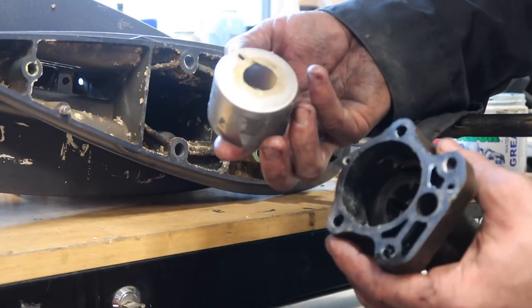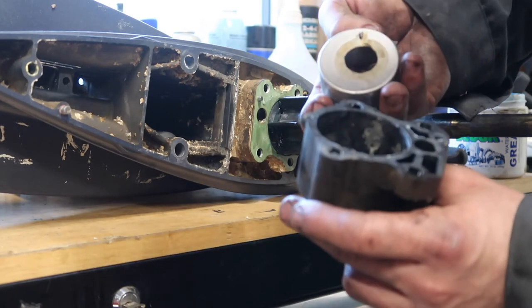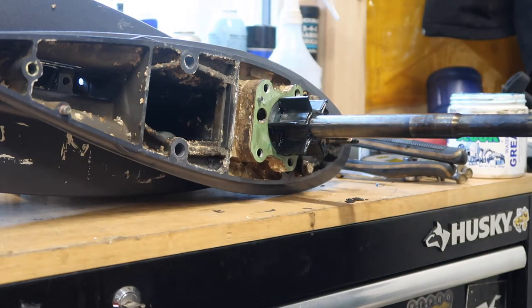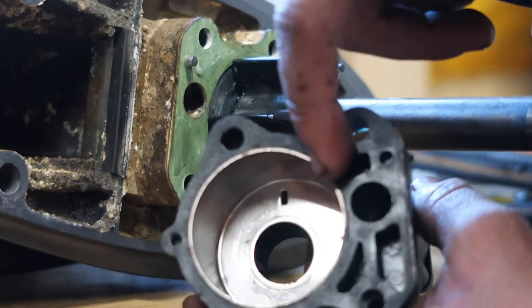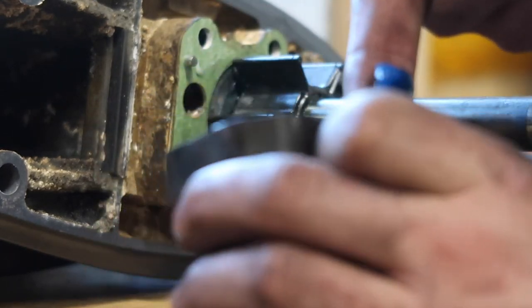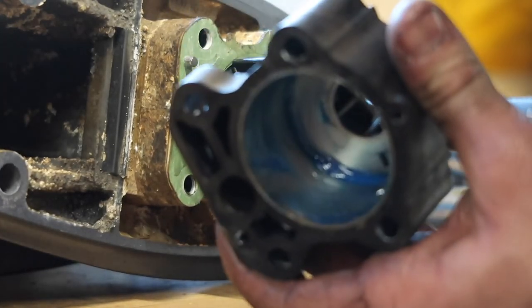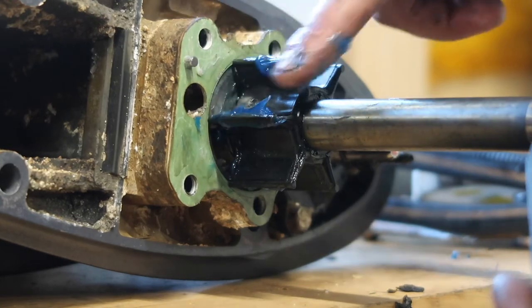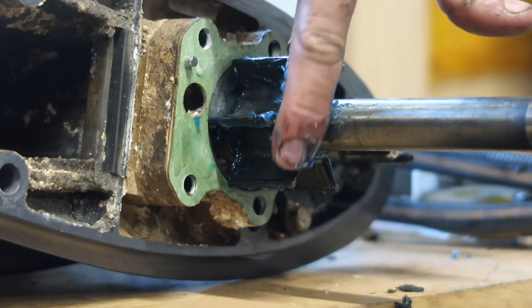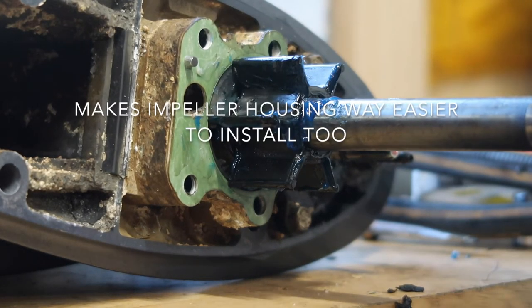If your cup came out of the inside of your impeller like mine did, you can put that back — there's a notch for it in there. Slide it down in. Our next step once we're installed — there's the little nub I was telling you about. We're going to take some marine grease and coat the inside. It's one of those things you don't have to do, but it's the way I was taught. I'm going to put the rest on the fins of the impeller just to eliminate the dry start-up. That's just what I was taught to do — if you don't feel you need to do it, don't.